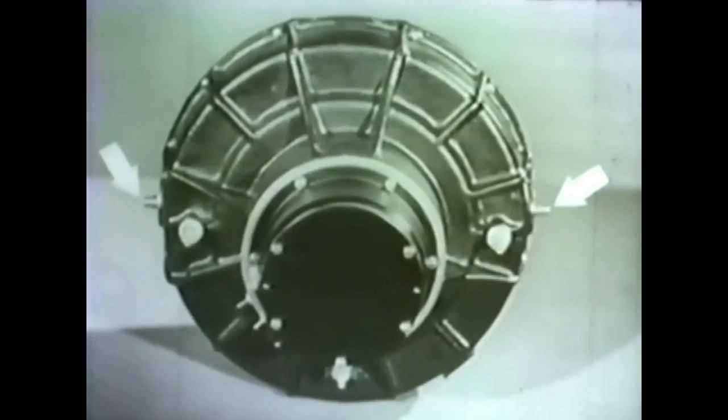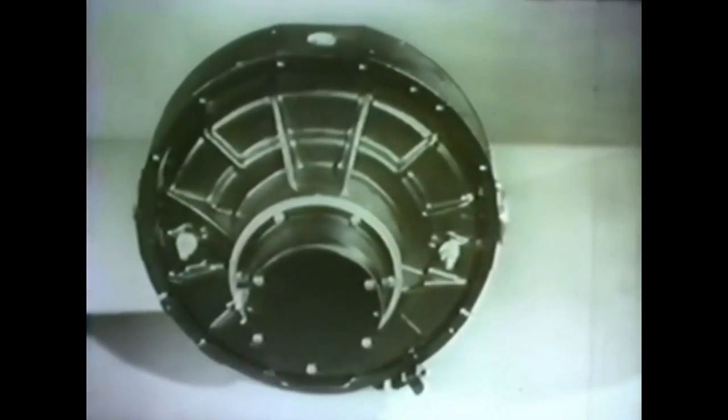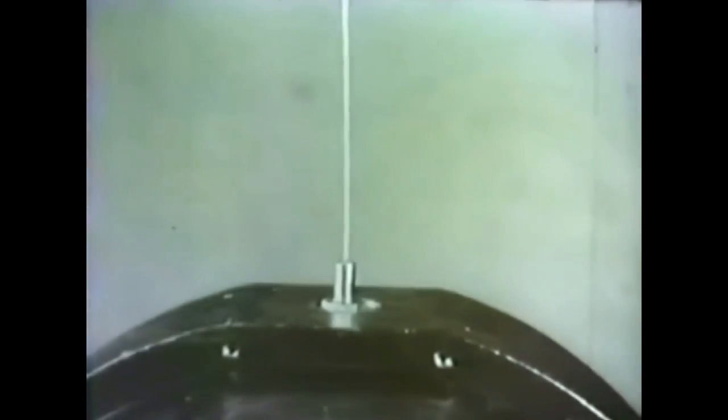This horizontal ring represents the Mark 14 case. On the sides, two horizontal studs support the case in the bearings which are held by the vertical ring. The rotor and case are located inside the vertical ring, just as in the model. Then the C-frame holds this assembly on the model, while on the Mark 14, the corresponding assembly is supported by a wire composed of 18 separate strands. This is the basic component of the gyro compass, and the first of our five major assemblies.